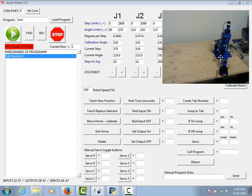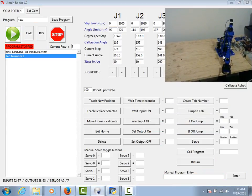So basically the way I have it set up, if I want to turn one of those relays on I have to set the output off, because this board is reversed. You may have a different board where you don't need to do that — you can delete that section of code that I just showed you.